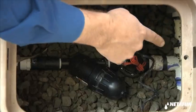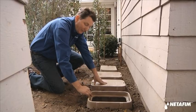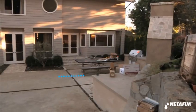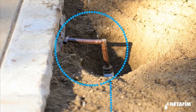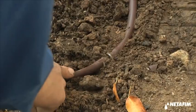You can see right here, the water comes through this mainline pipe, goes into the PVC pipe, starts here, goes across right below the soil — in this case 6 or 12 inches down. The PVC pipe will come out where we have our stub-up, so we can irrigate directly through this tubing and through the emitters to the roots of the plant.